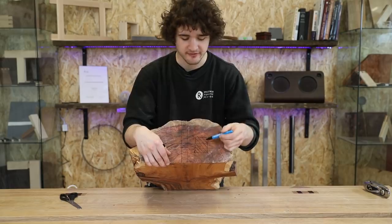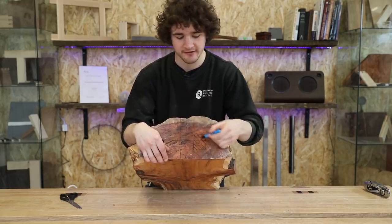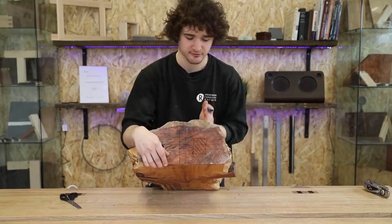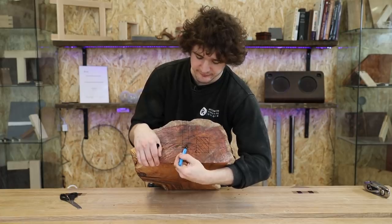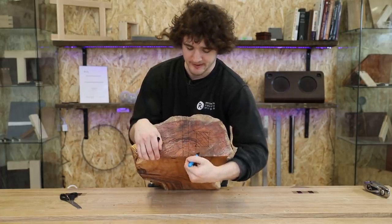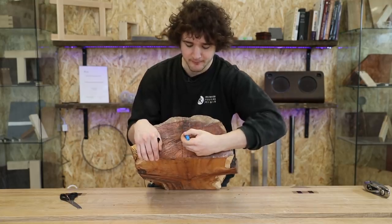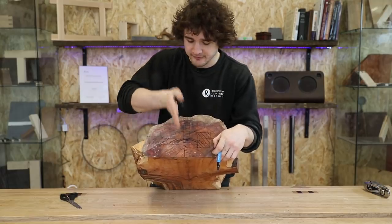The advantage to this is that this gives you straight grain on all four of the sides, because the lines are going diagonal and they're going to go straight down from there. Whereas on a through sawn board, where these lines are sort of scraping the top surface like that, that is what gives you the crown cut pattern. Quarter sawn, you're going to get the most linear grain from it because they're going perfect right angles to the surface, which would be here.